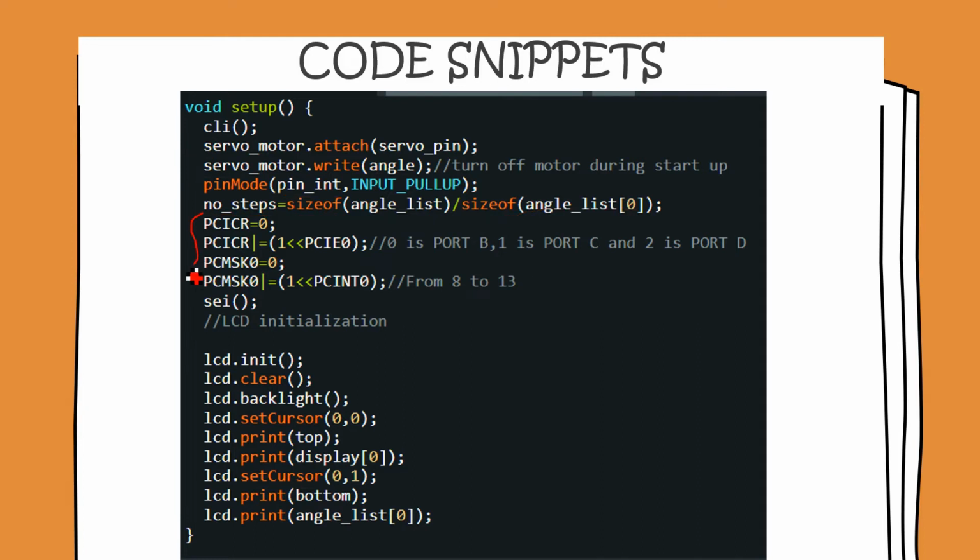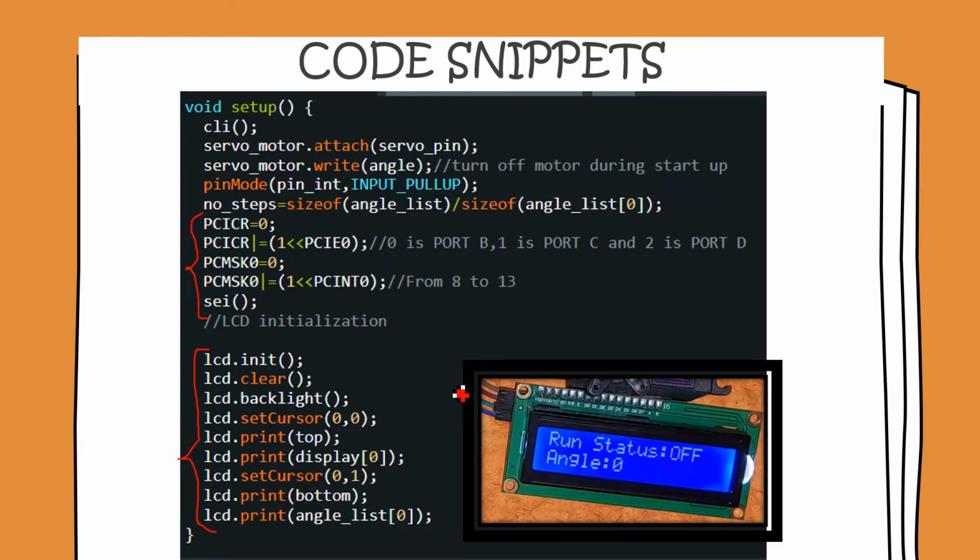We then have this set of lines which are basically used to configure the pin change interrupt on pin 8. There's a detailed tutorial on pin change interrupts, the link to which will appear on the top right of the screen as well as in the description box. There's a set of code to initialize the LCD screen. It's being initialized, the backlight is being turned on and the LCD is being cleared. The net result of this code is to type this out on the LCD screen: run status equal to off and angle equal to 0.